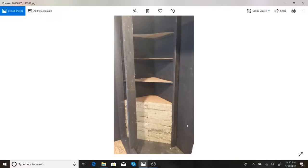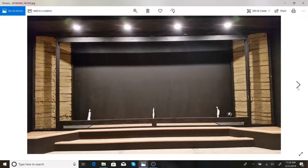There's a good shot of what it looks like as you start stacking the Rockwool triangles. I cut the cardboard triangles short so they don't stick out and you can't even see them. Everything gets painted black — all the two-by-fours, everything — so you don't get any light reflection. There are the two bass traps, loaded floor to ceiling and staying stacked well. They'll be covered later with speaker fabric so the fiberglass isn't exposed, and there's rubber mat underneath.